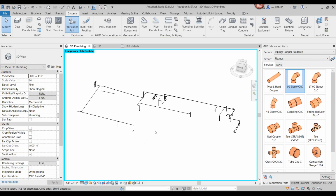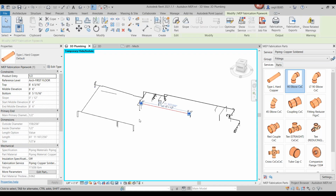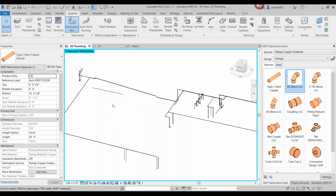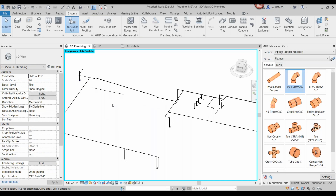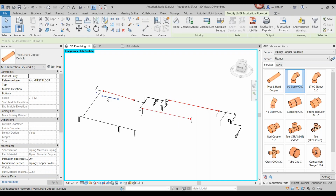So that brings me to the next thing. Wouldn't it be nice if Revit could take what is a 61 foot long pipe and make it those predefined lengths that I wanted? You saw that it was bringing in 4'11" duct lengths when I was placing them that way. Pipe might come in, I think this one was a 20 footer. Yep, this is set for 20 feet. I'd like to break this up into 20 foot segments. There's a few that are big time offenders here. Let's go with these five.